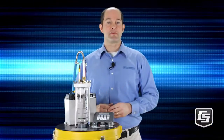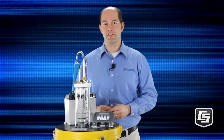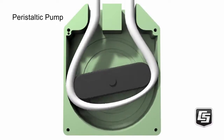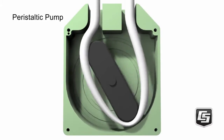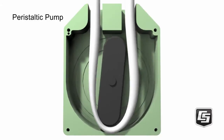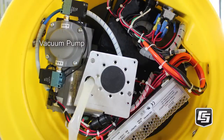The main advantage of the vacuum system is that no moving parts touch the liquid, ensuring a representative sample is taken each time. In a peristaltic pump, the tubing draws the liquid and can get contaminated and worn — it goes through a lot of wear and tear and becomes unreliable over time. In a vacuum system, the moving parts are in the pump itself, which is underneath.